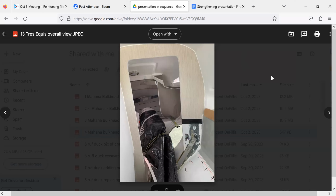He describes sailing along, sleeping, and being awakened by the sound of the entire tabbing ripping from ceiling down to the floor, which would wake you up. And the report from the boat builder who did the repair work was that the tabbing failed at the 90-degree bend. It did not delaminate. It just ripped. I didn't ask about the filler. No, that's what it sounds like to me. If it's a catastrophe in the corner, yes, the fiber's not... Right, that would be it.